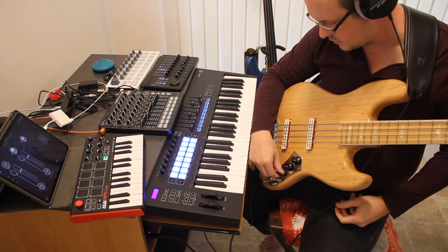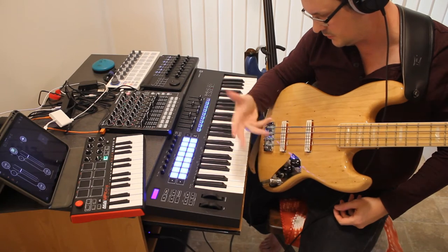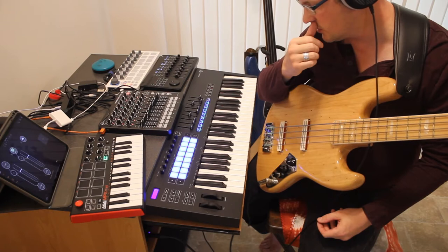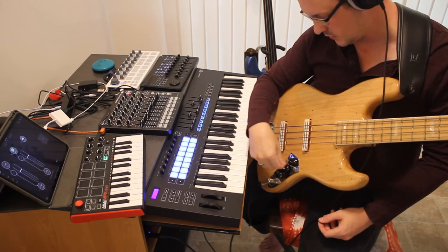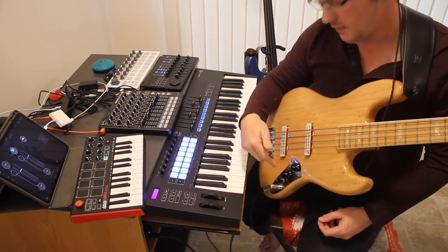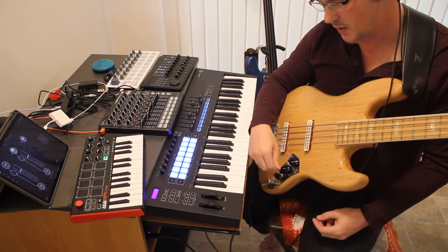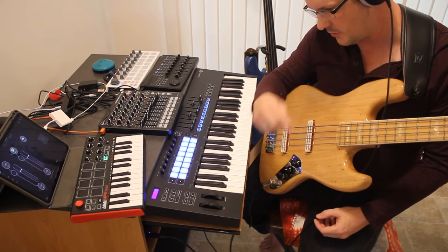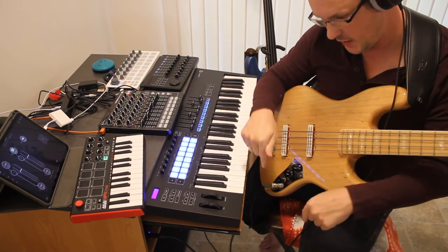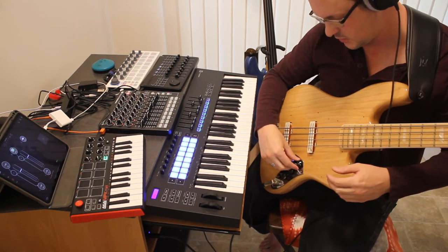So yeah, that's pretty much it. With this kind of setup, there are pros and cons. Like with the three-way toggle switch, if you put it in series and throw it towards the neck, it mutes it out. If you have a series parallel blend knob — well, the one that I'm making and selling on Reverb with the blend knob — the volume actually goes down when you're in parallel. It actually grounds everything out. So that's a weird one.